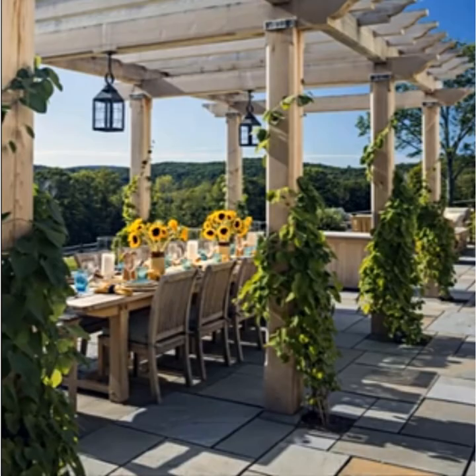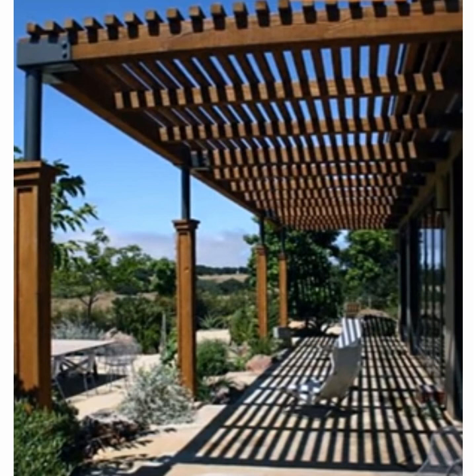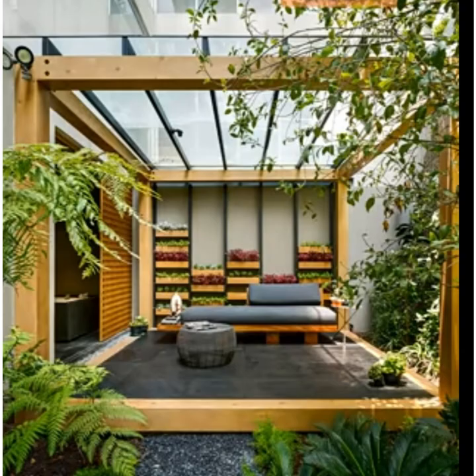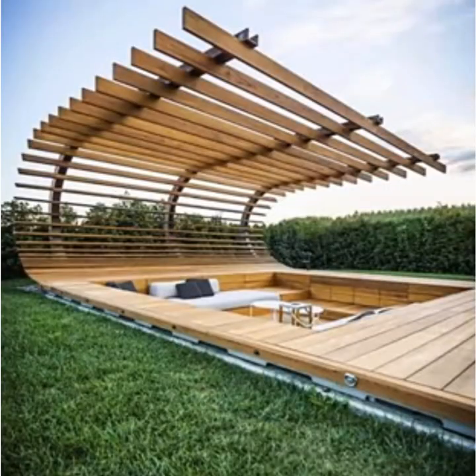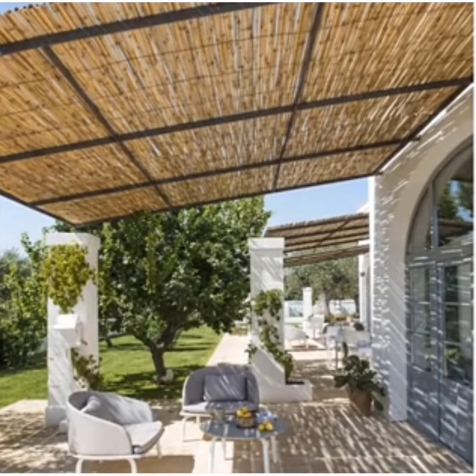Step 8 — Install wood plugs in the pergola columns. Cut 5-1/2 in. round treated wood plugs to fit the inside of your columns. Glue and screw together a pair for each column top, then glue the plugs flush into the top of each column. Secure the plugs to the columns with 2 in. deck screws. Drive a screw into the top of each plug to use as a handle to position the plug. Step 9 — Attach 1x4 shims to the posts. Screw 1x4 treated pine to the side of each 4x4 to beef up the post so it meets the inside edge of the hollow column. Step 10 — Attach the columns to the posts. Slip each column over its post.